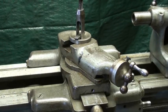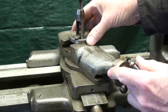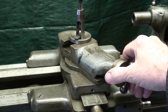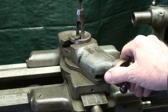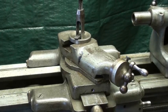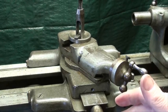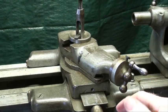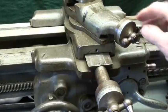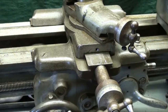We had talked about play in the cross slide screw and nut, and there is some play — not a whole lot, but I believe you're going to find that in all used lathes. It does have the satin chrome collars, which they started putting on these lathes at about that time. There is some corrosion on these collars. I cleaned them a little with steel wool, but they're still pretty easy to read compared to some of the older ones you run across.